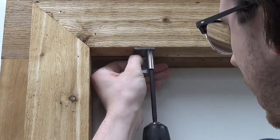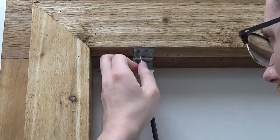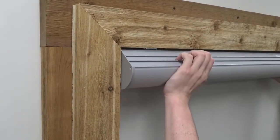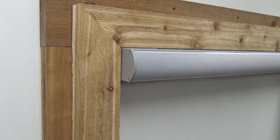Before installing the shade, use a level to ensure the brackets are level. The shade will not function properly if it is mounted unlevel. Shims may be required for leveling. Install the shade by resting the cassette in the groove inside the front lip of the bracket, and then push towards the back of the brackets until it snaps into place.